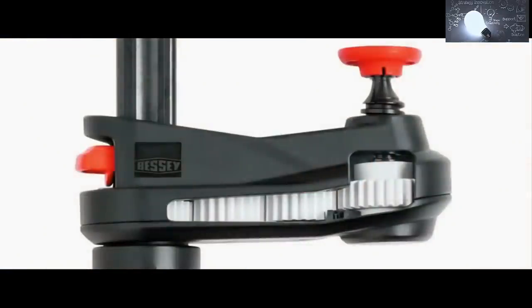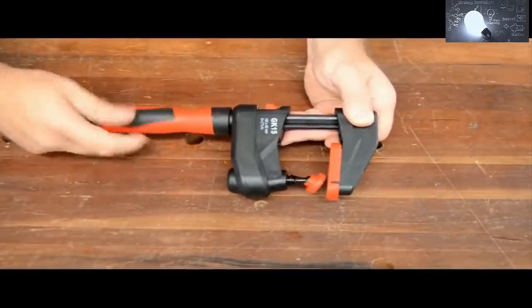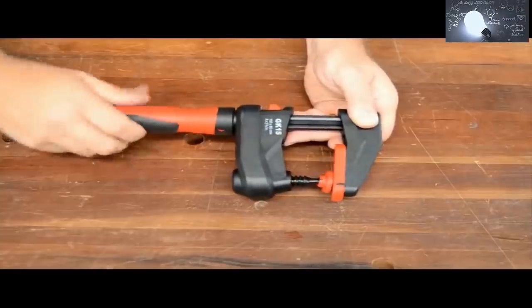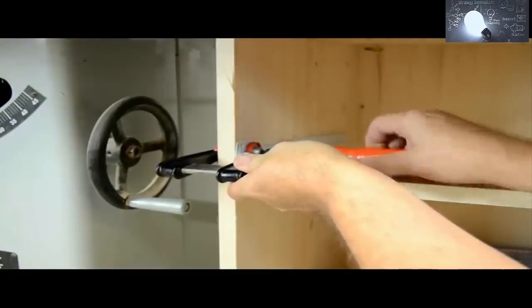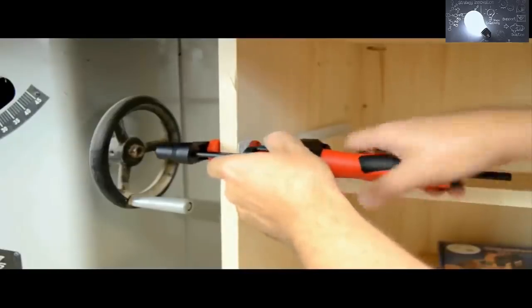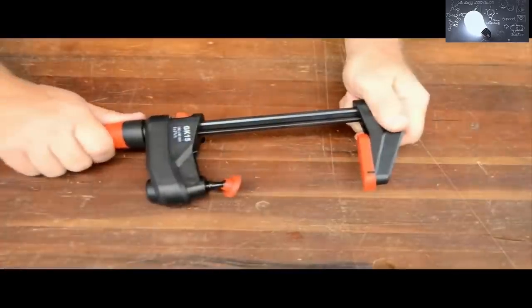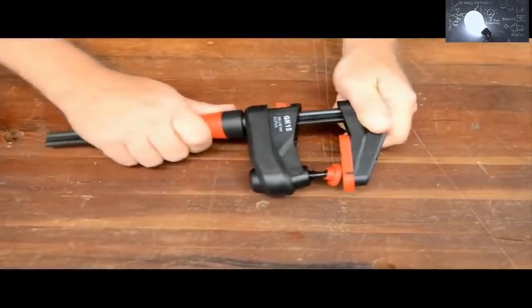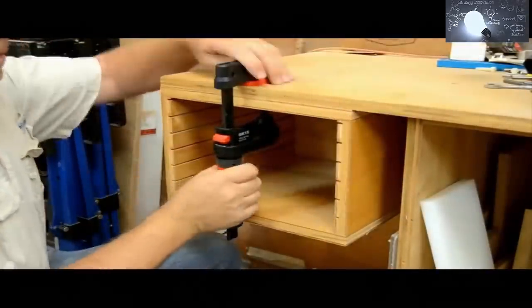What makes this possible is an innovative gear train sealed within the clamp arm, allowing for the Acme screw to be operated remotely, a feature not found on any other clamp. This means that in tight locations where an F-style handle may be obstructed, the handle of the gear clamp is outside of the working area, allowing for a proper grip and reliable clamping. In addition, the arm of the gear clamp features a clutch mechanism, which allows the arm to be closed with just a push, then released with a simple trigger, allowing for pre-setting the arm position when needed.